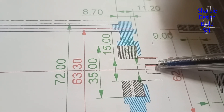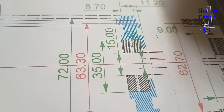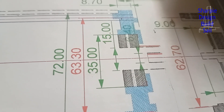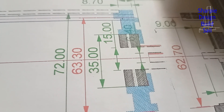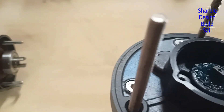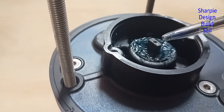What I'm going to do is make up a spacer, as shown here — it works out to be exactly one millimeter either side. That'll be a bit tricky, but it so happens one of my rulers is exactly one millimeter thick, and I've got three of them — three six-inch rulers. So I might be using that ruler material, which is a good resilient, semi-stainless steel. I'll be making up spacers which slide onto this shaft, and the other one will fit over the top and won't be able to fall out.